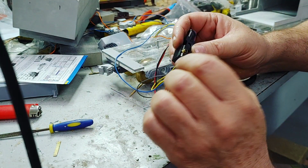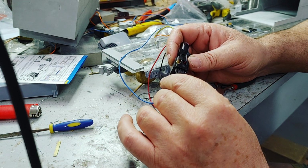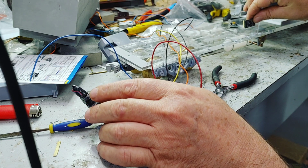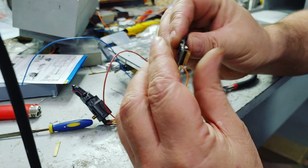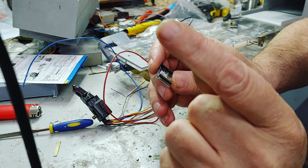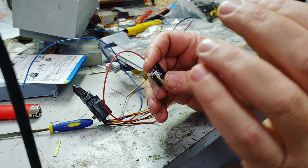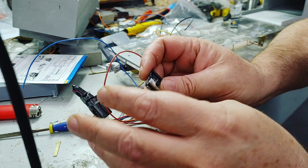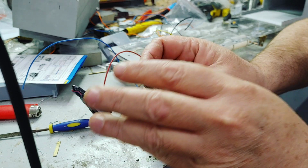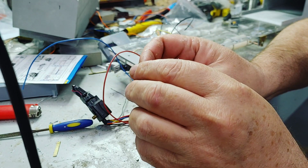Now, why I'm making these videos, I want to tell you dudes something. You cannot, on a normal 21-pin ESU decoder, do a dynamic smoker. The output's just not there. Yes, you have the auxiliary one, but you do not have the pulse function that will make the fan puff according to the sound.